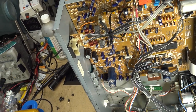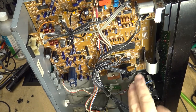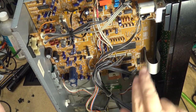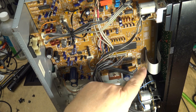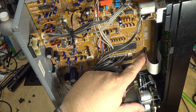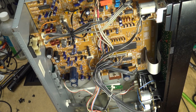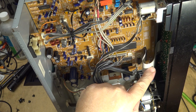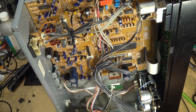And to take the board out, I'm going to have to take out all the screws, undo plugs, right? I don't want to undo things unnecessarily, because that's always the time that something's going to break. And you take out these ribbon cables, they sound easy enough, but sometimes when you're reinserting them, the copper peels off of it, and then you've got a damaged ribbon. So if I don't have to, I don't. So let's find a new resistor.